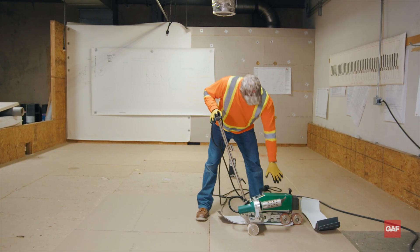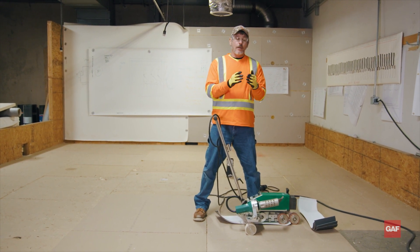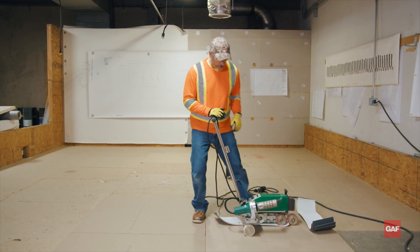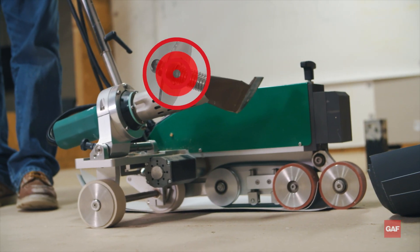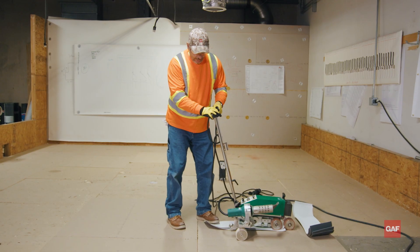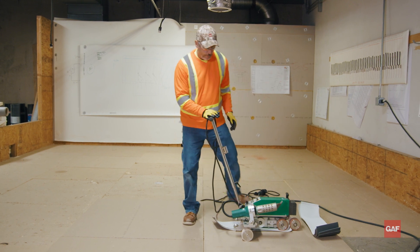When you set this up, my drive wheel and pressure wheel — I kind of want that overhanging the seam maybe about a quarter of an inch. I don't want it too far on one side; just overhanging about a quarter of an inch. I've also got this little pizza wheel back here — it's kind of a guide. When I'm in the weld position, I slide this over, that pizza wheel kind of drops down and runs along the seam, letting me know the machine is straight. Some people use it, some don't — it's personal preference.